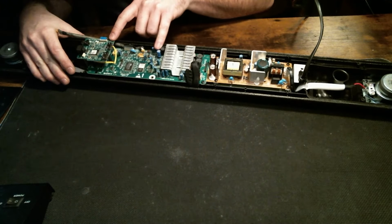So what we'll do is grab our voltmeter. We will put it on tone, or beep, or whatever you'd like to call it. And let's see if I can do this. Yeah, we got the two prongs right there, right at the bottom. Carefully see if we can get in there. We're not plugged in at the moment. Okay, one there, and then one down here. We do have a tone, which means this fuse is likely okay. So that doesn't appear to be the problem at this time.